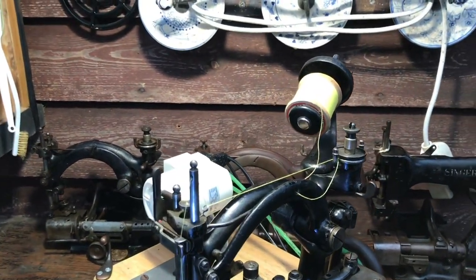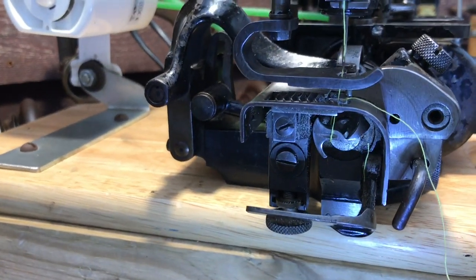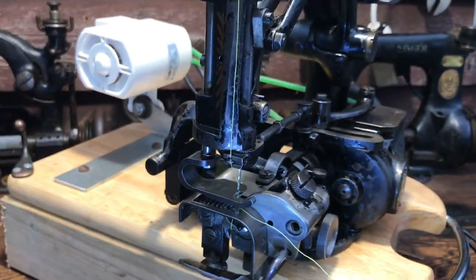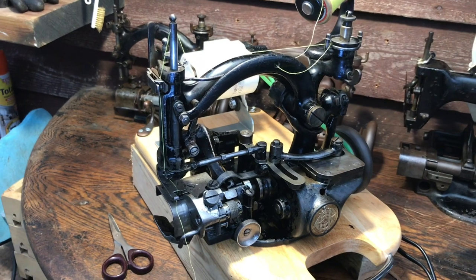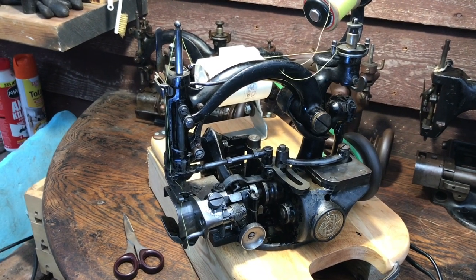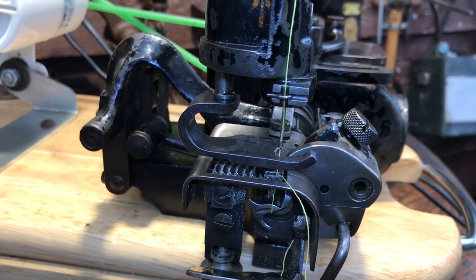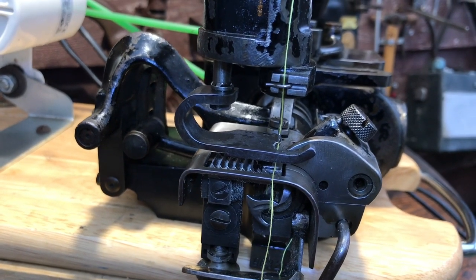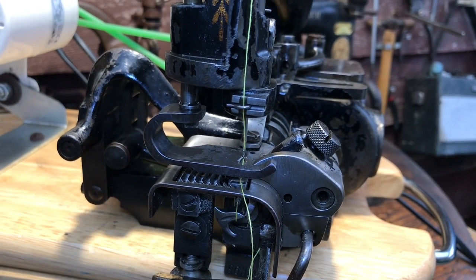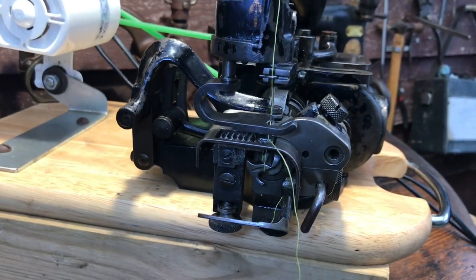Then it comes down — there's another little guide there — and goes straight through. With chain stitch hat machines you only have the top thread; underneath it's caught by the hook. As you can see, the hook is exactly the same as a Wilcox and Gibbs hook. Heinrich Grossmann copied most of the Wilcox and Gibbs design, quite legally because all the patents had run out. What they added was the extra zigzag. You can also see from this angle the enormous foot and enormous feed, because they were pulling through much stronger, stiffer work.